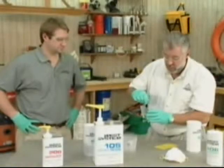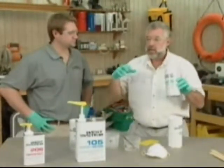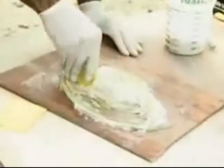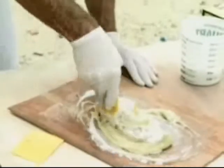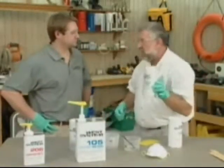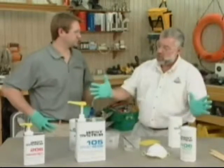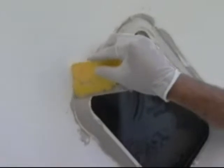Good thing we're inside the boat shop because it's raining. Before the break, we were talking about this product — this is called 406, it's colloidal silica. It is very strong and gives great strength as a thickening agent for epoxy. But the downside is it's not easily sandable — it's really, really challenging to sand. We want to make some type of a fillet around the outside perimeter of our port lights so that we can blend the boat and minimize those window openings, and that leads to fairing compounds that are easily sandable.